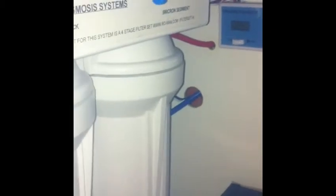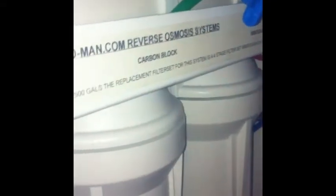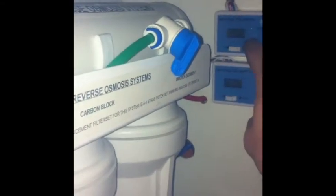What I have done is had an additional meter, because I really want to take out some of the guessing work of when to change my 5 micron and my carbon filter. Once it passes my 5 micron and my carbon, and before my RO system — which is down here, plumbed in here — that will actually knock it down to around about 430.